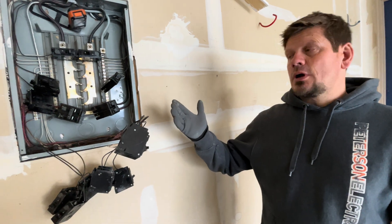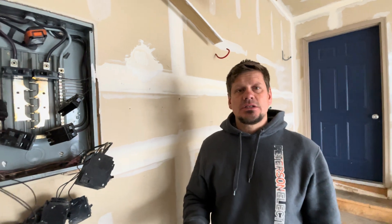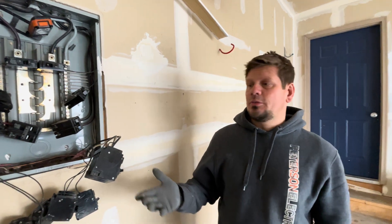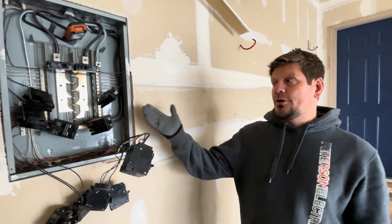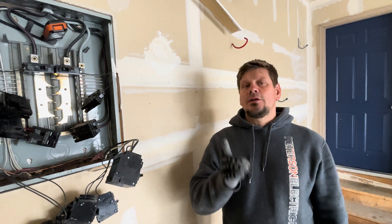Please subscribe and like. This right here is an example of lights flickering. When you get on there and AI technology says it could be a light bulb, a dimmer, LED versus halogen, xenon — it could be a switch, it could be a breaker, a panel, a bus bar, the main breaker outside. It could be worse and you're losing your neutral and your main feed to the home.